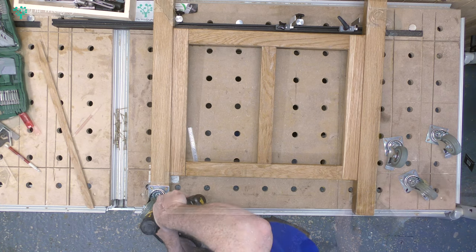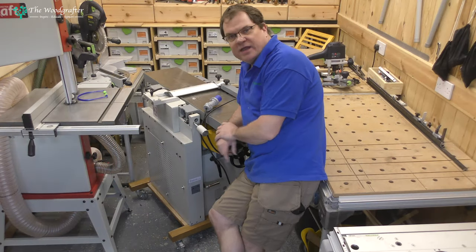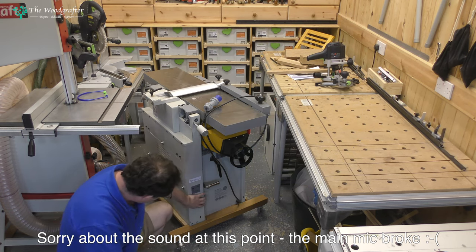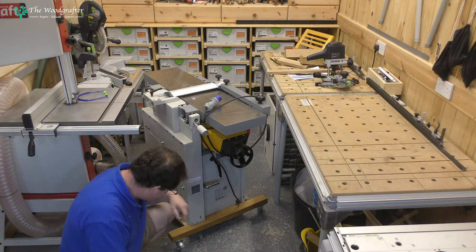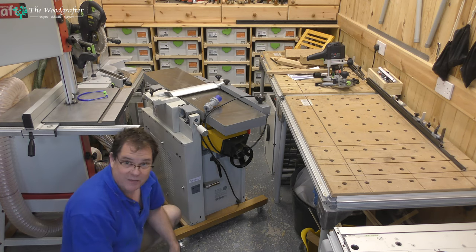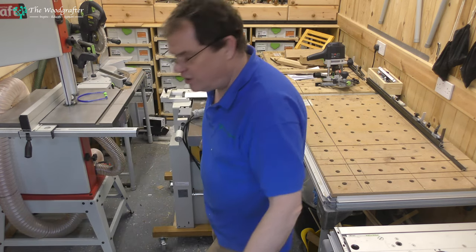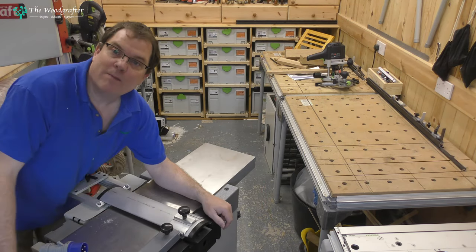With all four casters in place, this frame is now pretty much good to go and I can drop the machine onto it. And there you go — a mobile planar jointer. The frame worked pretty well. Now I did make a mistake: I didn't allow for this extrusion at the back. I took the measurements from the front and assumed the back was the same. So I've just routed out a small profile inside here for the planar jointer to sit — and actually it makes a very good feature. Yours will be different unless you've got the same model, so adjust the diagrams as you see fit. But overall, I'm pleased with this — I've got what I wanted: a mobile base.